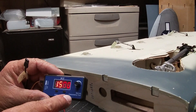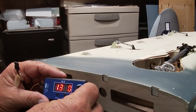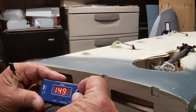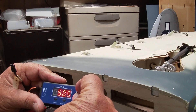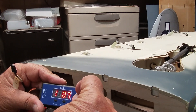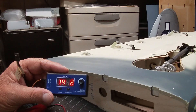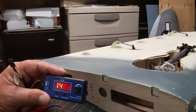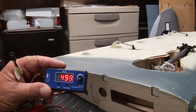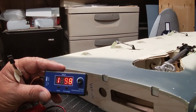When you turn it on, there's no telling where it's going to be, but for the most part all your servos, the center point is going to be at around 1500. So right around 1500 — right there, close enough. Plug your servo into this checker, get your servo centered, and then you can put your arm on at a 90 degree angle or however you need it.